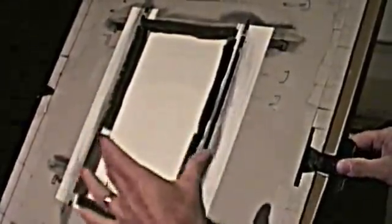Here's where the blank paper goes. Then folded down on top of it, another frame known as a frisket — which was simply a piece of paper covering a metal frame into which was cut a window, only slightly larger than the image that was to be imprinted onto the paper. So, paper goes on the tympan, the frisket is folded down with its window cut into the surface.